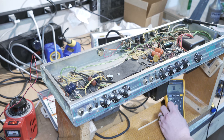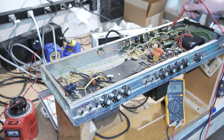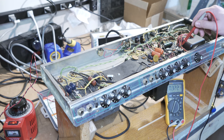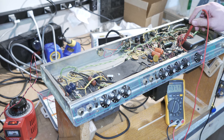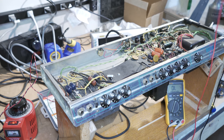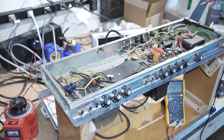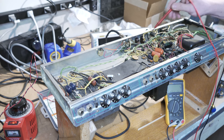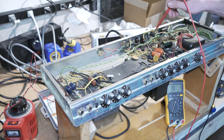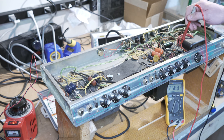I will first put this on AC volts, and I will see at my input, I'm getting about 10 volts AC. So that's going through the transformer and should be coming out the transformer. Also, some voltage DC or AC as well. 3 volts, that's weird. Oh, I don't have the power on. Ten volts there. I'm just trying to see base really low level voltages and make sure they're coming through. It's coming out the transformer at this end. I have 25 volts, and that's what I'd expect.